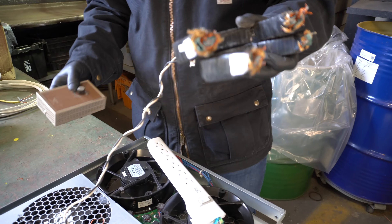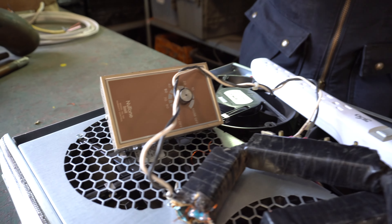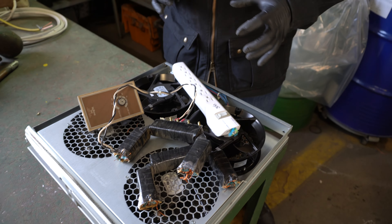Items like this, this type of CBM, are items that get sent overseas. Why? Cheaper labor — they may take them apart. They have different sorting and separating processes, there are ways to get the metals out. If you have a shredder that only shreds CBM, you can put it through, make it into small pieces, easily get the steel out by using a magnet, and then use air flows to separate the copper, the aluminums, the brasses, the plastics, the residue, the garbage.